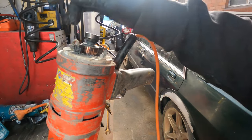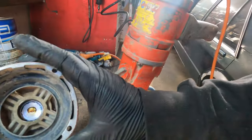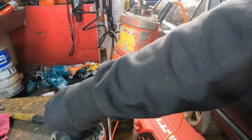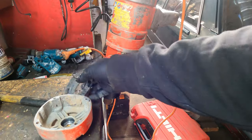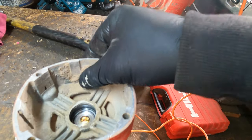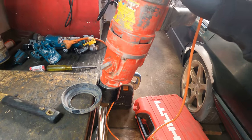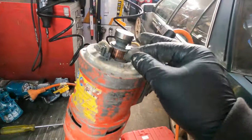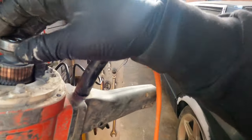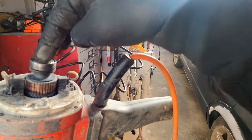You can use degreaser or spray, whatever you want. And this one, clean it as long as you don't have any sand and dust here, okay? I put it in my washing bay. A lot of dust here, see? This causes a problem. When this one flies in here, it makes it like sandpaper. And it may damage your armature. This armature, this will cut your arm and legs.